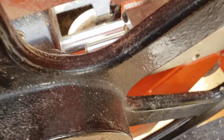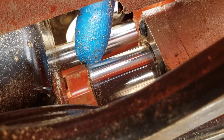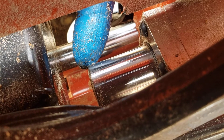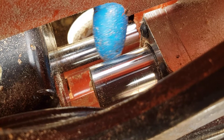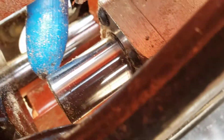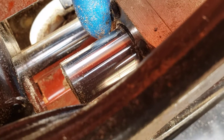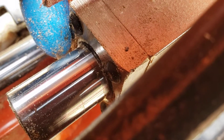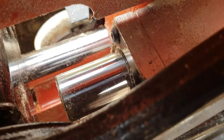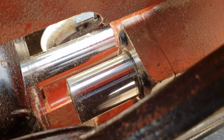What they say is: don't put your tool any further away from the end of that shaft than a quarter of an inch, because when it goes into that area there's a seal in there, and if you start marring that shaft you're going to start leaking fluid or lose the seal. Anyway, that's my input from a rookie Wood-Mizer user.